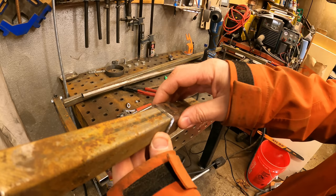I've got this figured out now. I'm going to raise the mill up — I just did that last cut cammed up, cutting at 1.25 inch cammed up, and when I'm cammed down on the lobes I've been cutting it at 1.5 inch with my set works. I added some springs here to keep this thing from hopping a little bit too — each one of these little risers has a spring on the side now. I'm going to bring the mill back. Got this set at 1.25 inch, we're going to set it over to 1.5 inch and hit enter. Ready for our next cut.